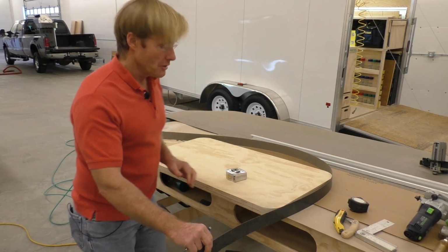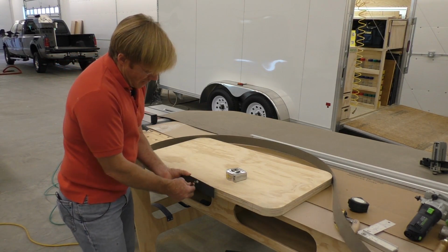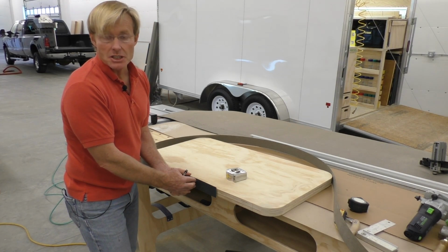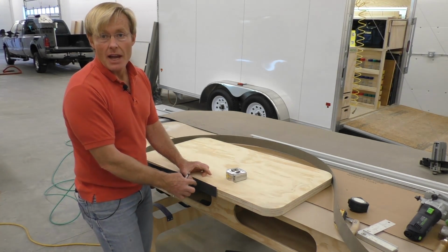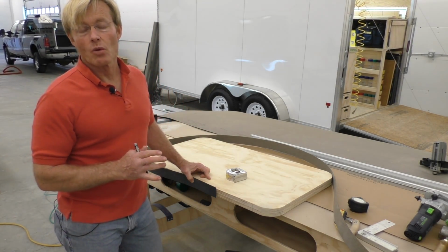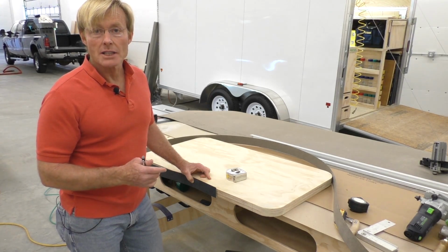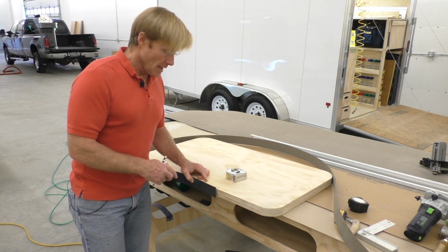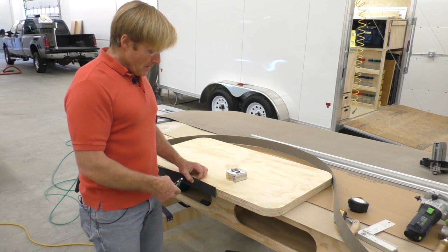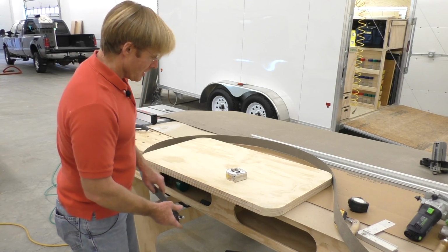I want to cut the edge banding to the proper length. It's going to come around and come together, and I want to have it so that as I work around gluing it on, it comes together and touches, and not try to cut it after it's glued up. Now, I don't do laminate in any kind of production form. I've done a fair amount of laminate in the past on my own houses and for a few clients, but typically I hired this out to a guy who does laminate all the time, and so they probably have a lot of techniques that would make it a lot simpler. But I'm just using woodworking techniques, and I just need to figure out how long this needs to be so I can cut it to the proper length.